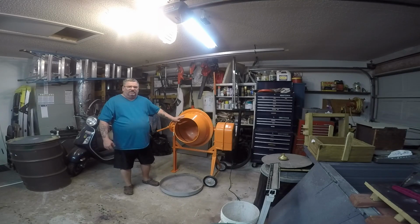Okay, so all-purpose sand, your basic formula, if you don't remember from the other video, is 95% sand, clean washed sand. In this case, sand that I got from Home Depot. It's a nice fine grained sand. Didn't have to worry about it being too coarse for making castings. The clay that I got is a Western bentonite that I got from a company called, and I'll have to remember it in a minute.